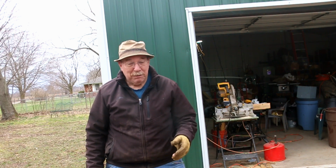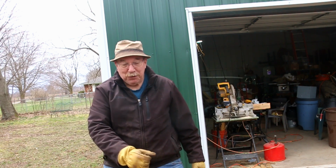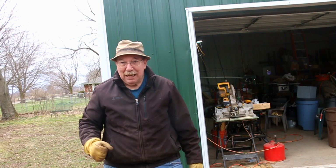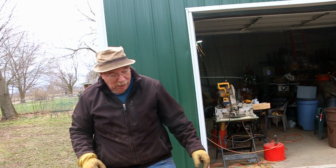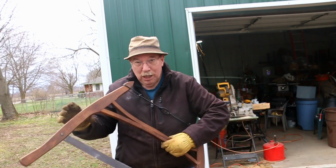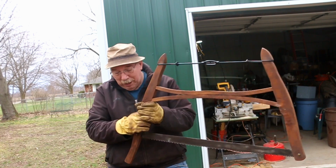Take your time, work the saw, and let the saw do the work. You don't have to bear down on it hard. You don't have to push or struggle. If the blade's sharp, it cuts. All you have to do is just drag the blade back and forth through. I wasn't pushing down on the blade. I wasn't trying to force it. All I wanted to do is put pressure on the handle and run the blade through the wood.